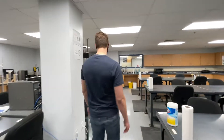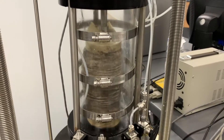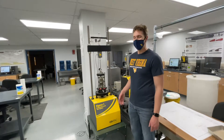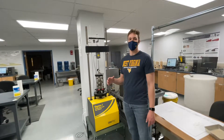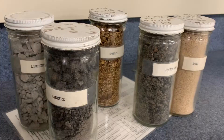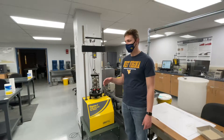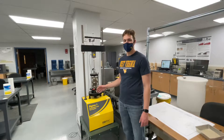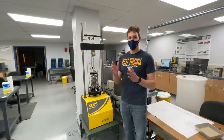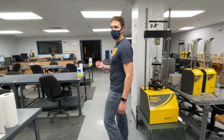Tying into my favorite test, here we'll be taking a look at the triaxial test. A triaxial test is a very extensive soil parameter test that can be run, which measures actual soil conditions for what the soil would experience in the field. A load would be applied in three different directions to give an idea of how it's going to behave under compression and loading, as well as how it may swell or shrink, depending. Let's take a look back at where all this soil is coming from.